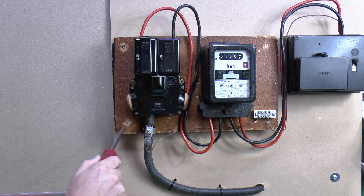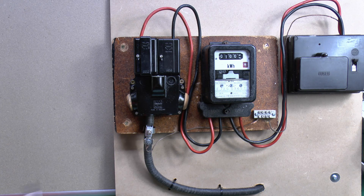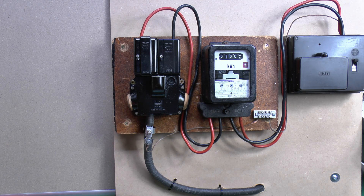It's the same reason why you don't start undoing the screws here and trying to move the board, because the danger of failing that cable is significant. What you should be doing is to call the DNO, whoever they might be, and then request a service alteration. They can relocate this equipment to somewhere else in the property, or more likely outside into a metering cabinet. Bear in mind that even when they come along to do it, they don't start undoing this and moving this cable, because again that's too dangerous. What will happen is they will go out into the street or your driveway, dig a big hole, and then simply cut the old supply cable and join on a brand new piece which they've already installed to the new location. Even the DNO don't actually start taking these apart and moving them, because the risk of an explosion and fire is simply far too great.